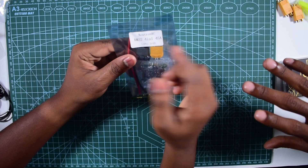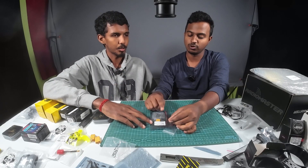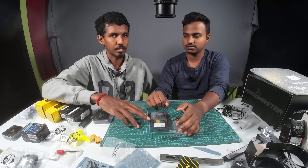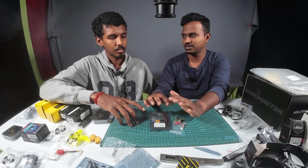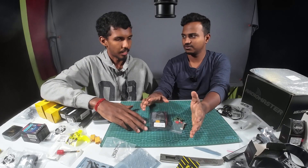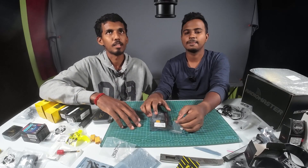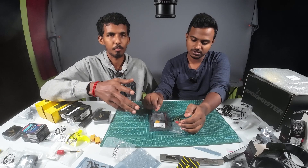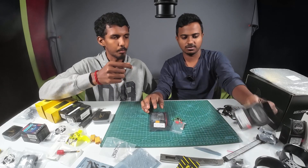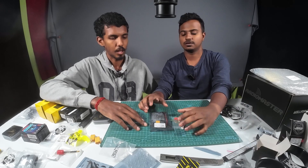What is AM32? AM32 is the processor's name. It is a 4-in-1 ESC model. The maximum power output — does it include 45A? It includes 20A, 12A, and also 80A options. If we ask the motor for peak output, we have 38A, so we can choose 45A. The key rule is the motor's peak current consumption. At full throttle it's around 24A, but 5–10A is the typical draw. We can use this ESC to supply it.